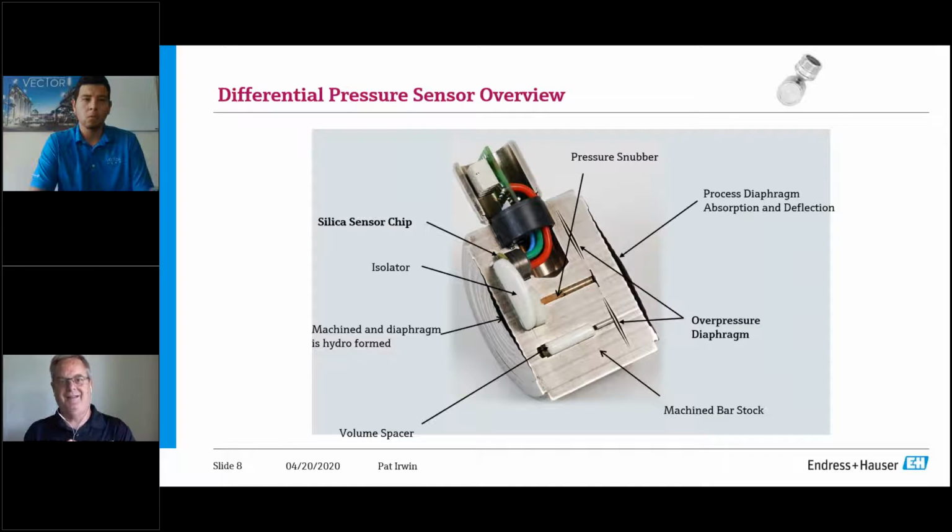So that's a lot. So what you want to do is open that equalizing valve, then it takes that whole 300 PSI environment, even if there's a little delta between the two, and it equalizes it inside. So the transmitter is net neutral at zero static across either side. So the transmitter lives in a comfort zone because those sensors are not seeing that additional pressure.